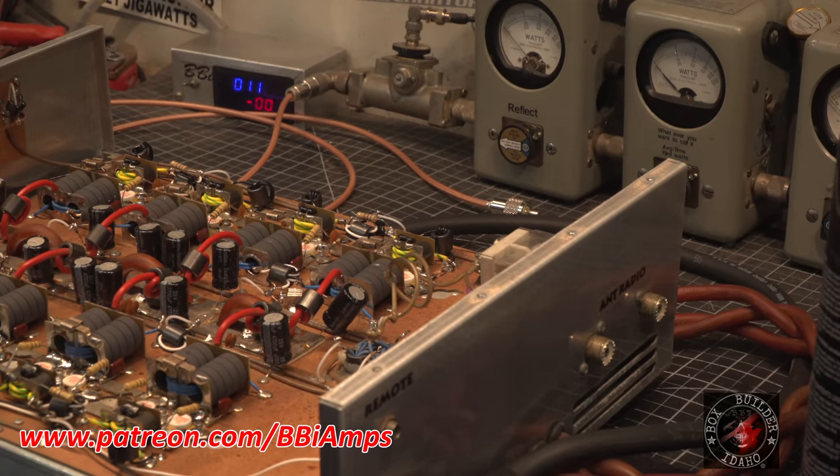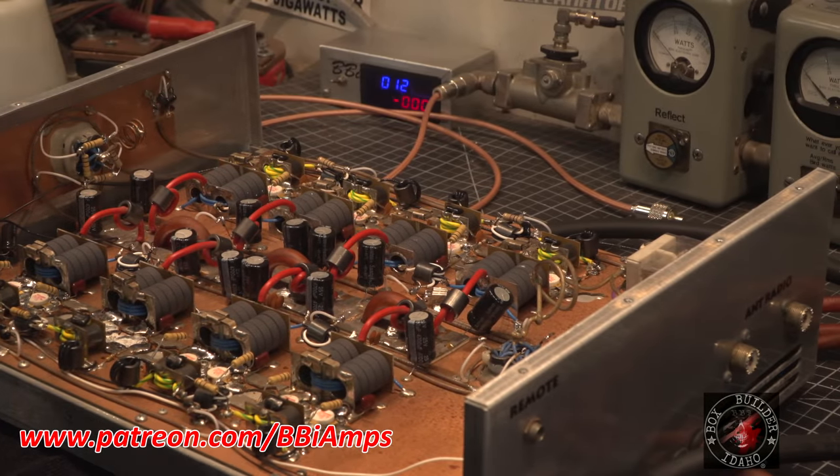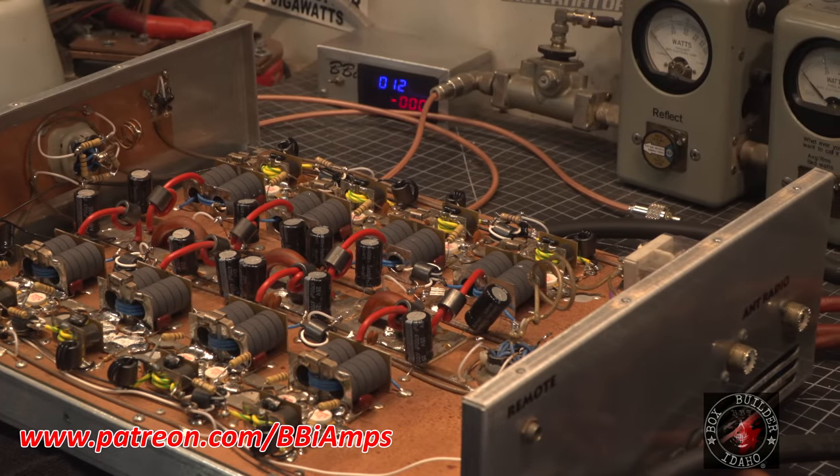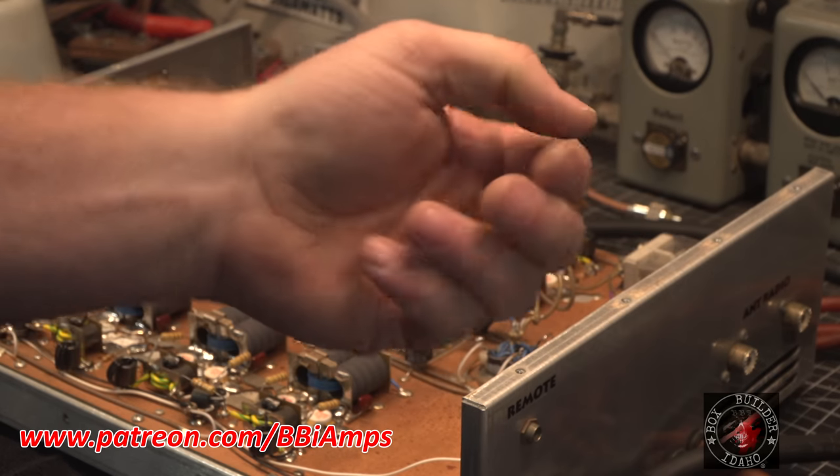Got all the metal clads installed. One there, one there, one there, and one there. The reason I like using the metal clads is they are a titch expensive, this is true, but they don't break down like these things do. What happens is if the amp gets overly hot more than a couple times, the chances are that these caps will break down and fail.